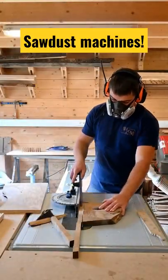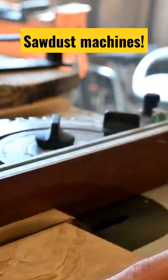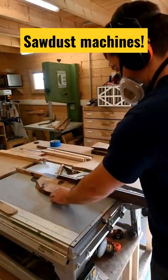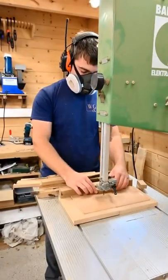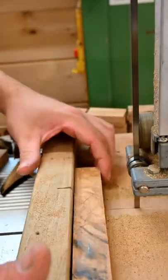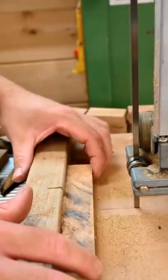The production process of a pen is quite straightforward. I start with cutting all the wood on the saw to the right width and length. Then we move to the drill press to drill the hole so I can turn it. After gluing and sanding, that's when the fun begins on the lathe, and only assembly remains.